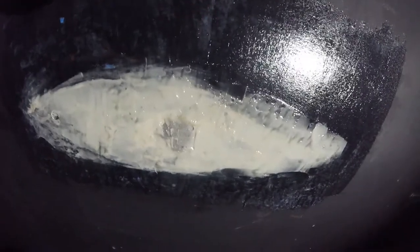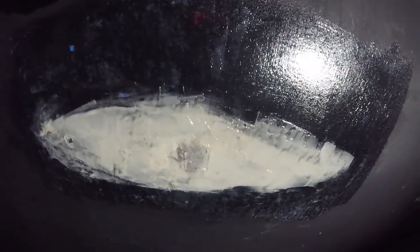All right, now we've put on the final layer of fiberglass, resin, fillers. These are hard, durable products. There's no fairing compound in there. We're not interested in fairing it. We'll sand these hard resin fibers smooth, and then we'll primer it, put some bottom paint on it, even though the transducer is going to cover all that.